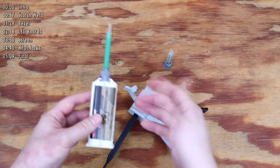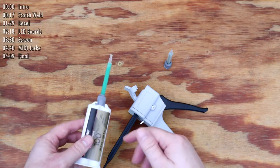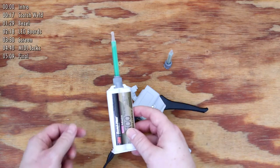Once the mixture is allowed to sit inside the nozzle for about 4 minutes, the epoxy will harden and that nozzle will be rendered useless. This usually becomes a factor in deciding how I'm going to work. Normally, I'd set up an assembly line and move through it as quickly and safely as I can to maximize the use out of each nozzle.